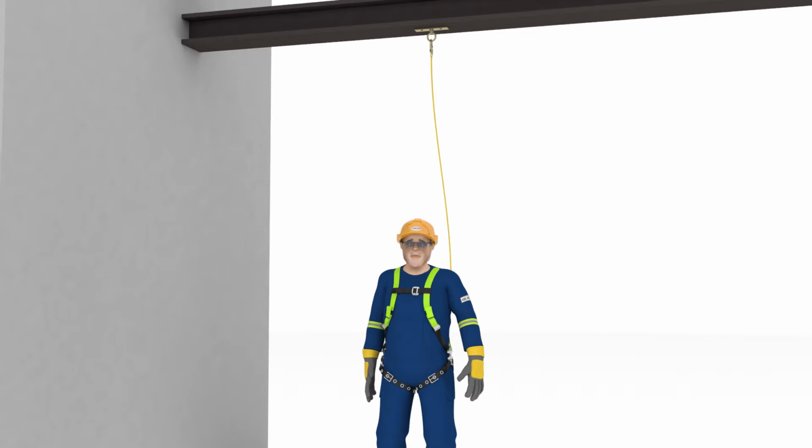Don't worry, Abel. We'll stop you before there's any force on your body. We're just going to see what your free fall is. Remember, free fall is how far you fall before your fall arrest system engages, or basically before you start to feel any force on your body. Go ahead, Abel.